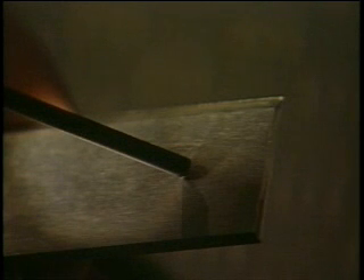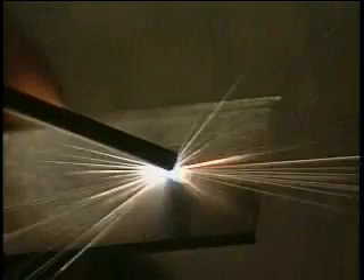During application, a very light touch is used so the electrode touches the workpiece with about as much pressure as an artist's paint brush. The spark gap that is created during the sparking action produces the deposit. Too much pressure will decrease the deposit.